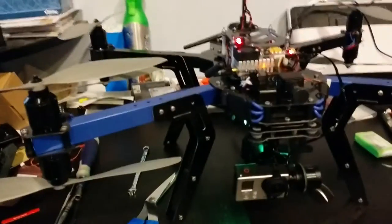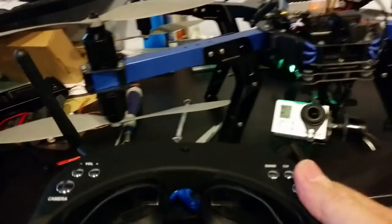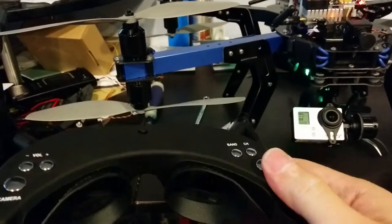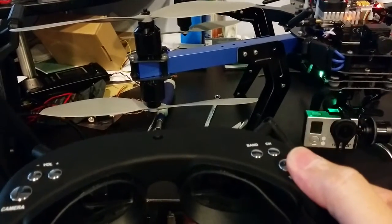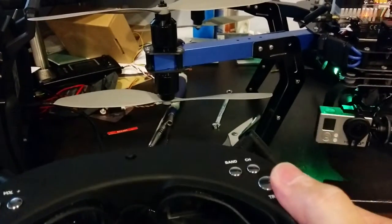Right now I'm not in trainer mode, so it is not listening to any input. But if I flip this switch up, it will put it in trainer mode and the camera starts going wild. The goggles have a track button right where my thumb is that will recenter based on the orientation of the goggles. So you put them on, hit the track button — that's your zero position. Then if you look down, it looks down; if you look up, it looks up; if you turn left or right, it follows. If it gets out of sync, you tap the sync button again and you're back to your neutral position.